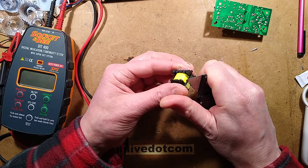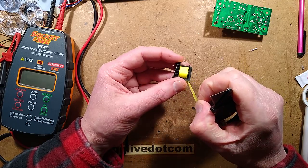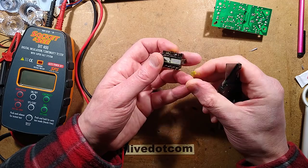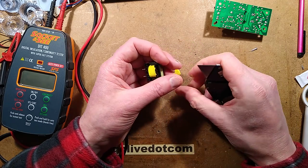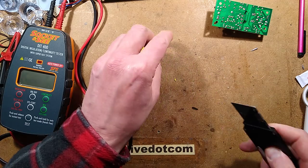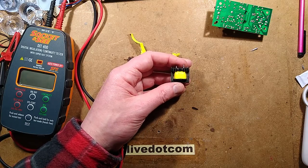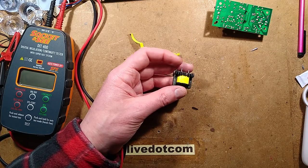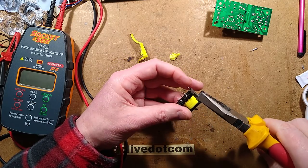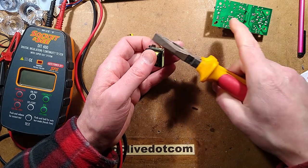It did pass its 3000 volts, which is considered a sort of extreme fault voltage. Although having said that, consider these USB power supplies, even good quality USB power supplies. People are plugging the little ionizers into them, which generate a high voltage with reference to ground as they charge the air. And those will potentially be flashing over, sparking over inside. Someone did send me a video of a power supply that was sparking inside, going snap, snap across the circuit board.